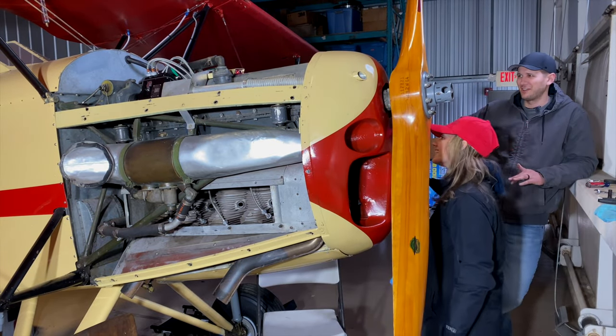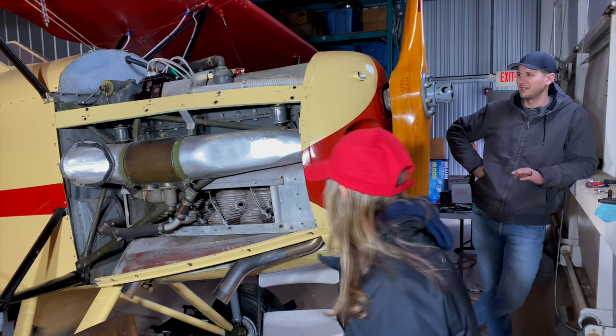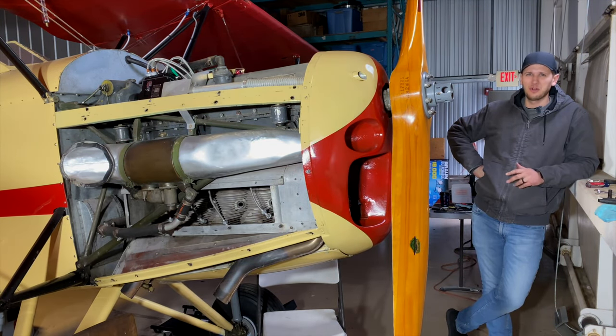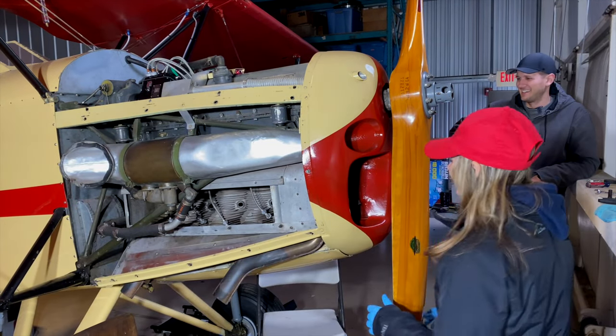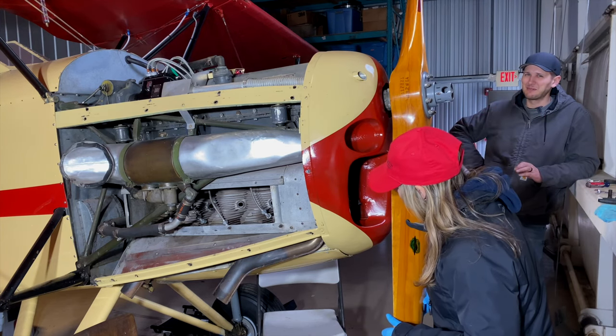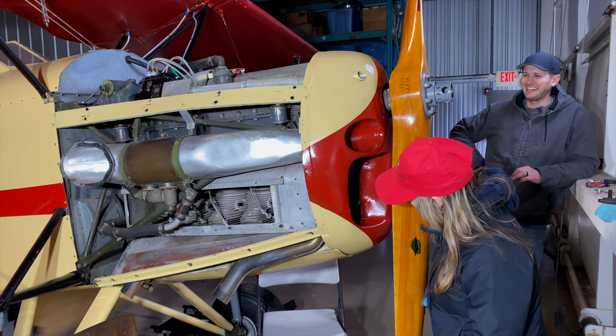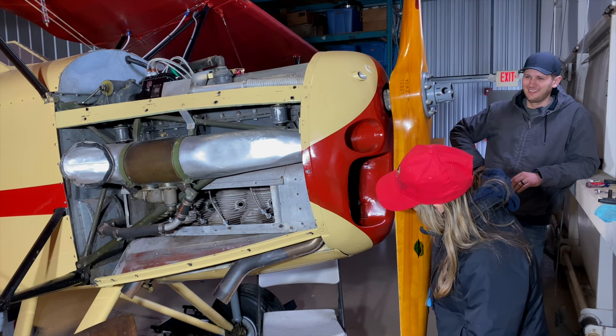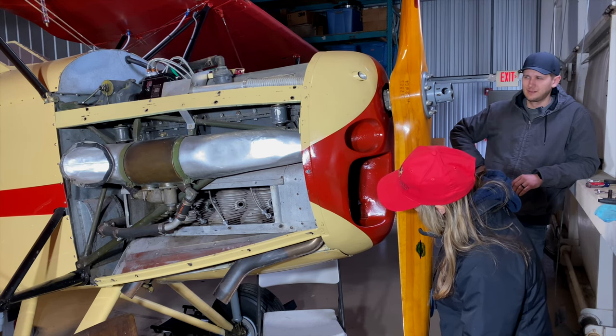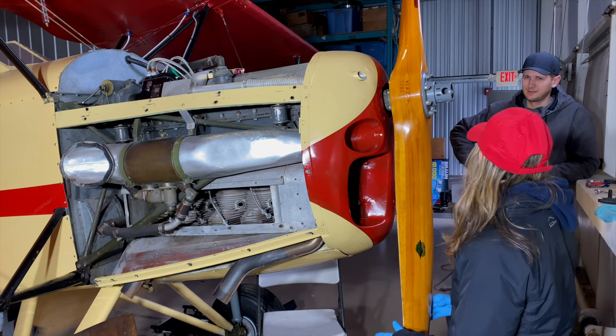Both mags are pretty much right there, just under 22 degrees. We hooked both up again and they should come on together. Never used a TimerRight before, but this thing has been pretty sweet for getting it accurate — horrible directions, but right on 22.